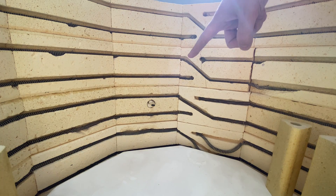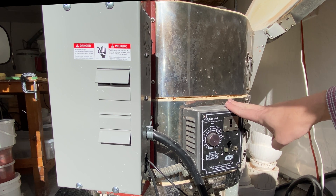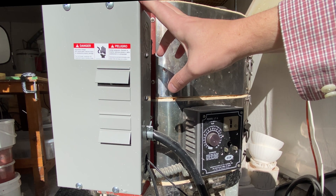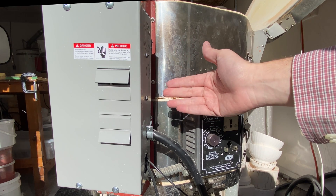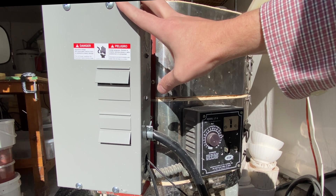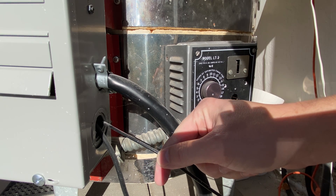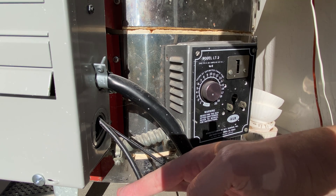So now let's jump out of the kiln and show the other side. Here is the outside of my kiln — apologies about the lighting, I had to open the garage door. There are basically two pieces here: this is where the kiln sitter was — I've taken all the pieces out and it's where the thermocouple connects. This is an electrical box where the relays and the Raspberry Pi sit. Behind that is actually the original box — I wanted to extend this away so it gets as not-hot as possible. This here is the high voltage line coming in, this is a USB cable connected to a Wi-Fi dongle so I can connect to my kiln controller over Wi-Fi, and this is a regular 120V US plug-in that powers the Raspberry Pi.